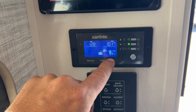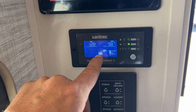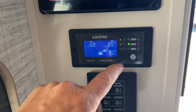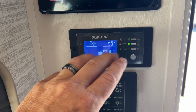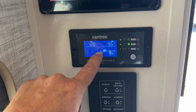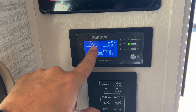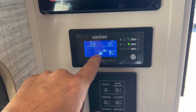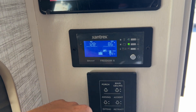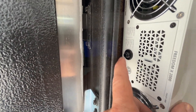We're not going to go over all the settings on here. Most of the time, if it already came with your unit, it's set up. I wouldn't go change anything unless you change your batteries. Go to your owner's manual if you want to change settings. Same thing for errors — most of your errors are going to be low voltage stuff. You'll have errors and faults that pop up because our battery voltage is too low. We'll also show you where the little breaker is on the inverter, and a couple of fuses on your system as well, depending on what type you have.